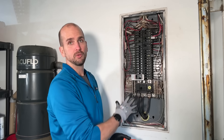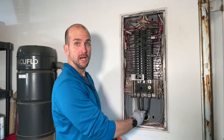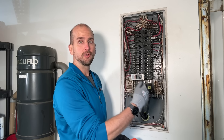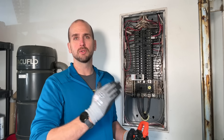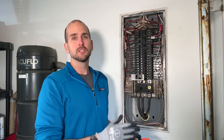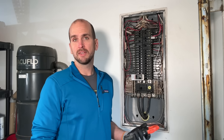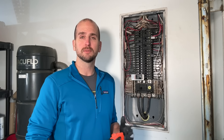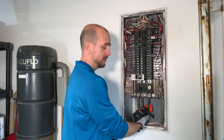I should have mentioned before I removed that panel cover — I actually turned on my critical circuits first. I want to use this current clamp to clamp around the two different 120-volt phases coming into the panel to make sure both phases are below 30 amps. It can be a little confusing jumping between watts or kilowatts and amperage, but just know that power equals voltage times current. So on a 240 volt system at 30 amps, that's 7,200 watts — 240 times 30 equals 7,200 watts.